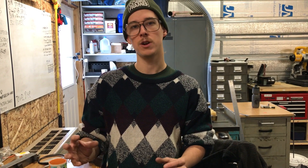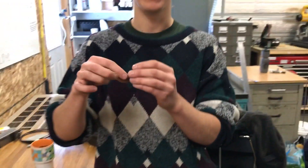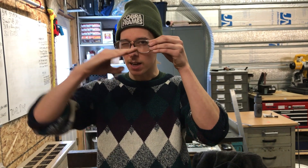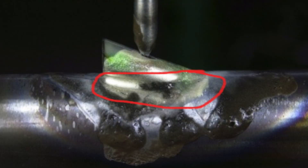Brazing is generally a little more accessible and easier, and goes a little smoother. If you have one of these chunky little pieces and you're trying to weld it onto your top tube in an unbutted section where it's really thin, you have a relatively thick chunk of material on a relatively thin tube, which could potentially compromise the strength. When you braze with silver or bronze, there's actually a little micro-fillet at the corners, so you don't have sharp hard corners and you don't have the potential to undercut your main tube.